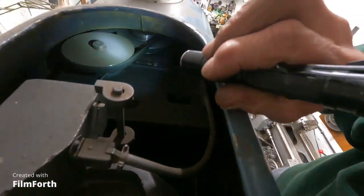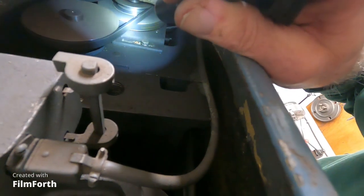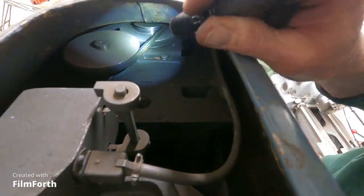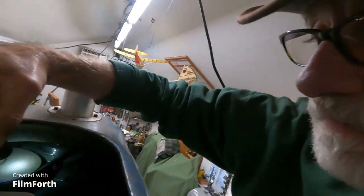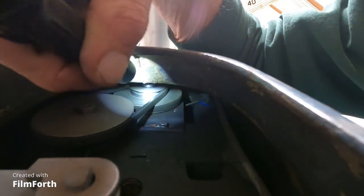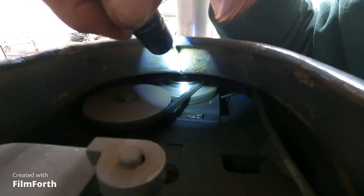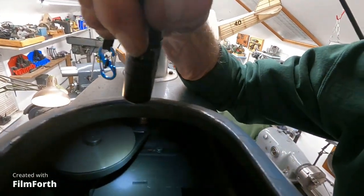Now the feed is right here, and you can see back in there — in the center, or to the right, is a double pulley. I put a double pulley in there to reduce the feed drive from the spindle. Right here is the drive mechanism for the spindle feed — that's how I reduced it. Okay, now we're going to get down and drill a hole.